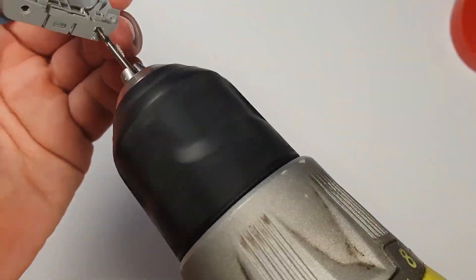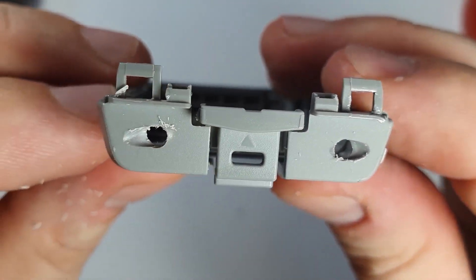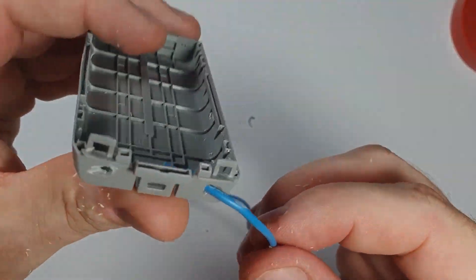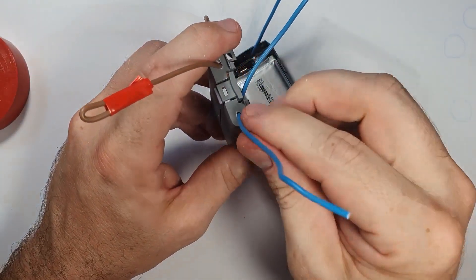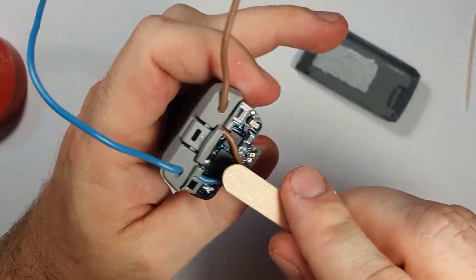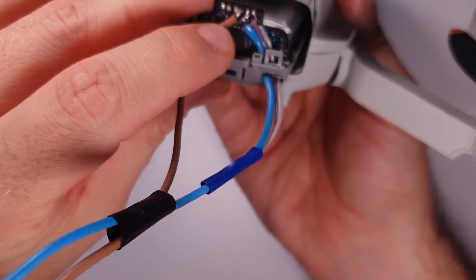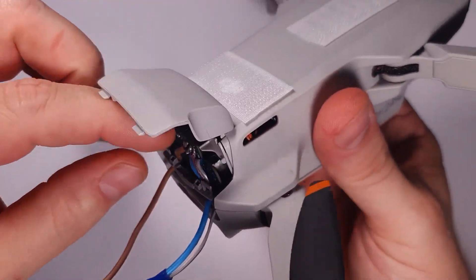I'm drilling here the two holes now. You may ask why I need them if I'm just soldering on the pins — I will show you later why I decided to do this. I'm threading through here the wires which I'm using to connect to the battery terminals to add additional lithium cells. I am not going to put back the lid of the battery for two reasons: to save some weight, and so the cell has more space to breathe and stays cooler.